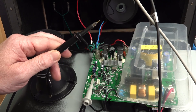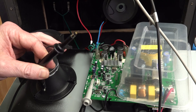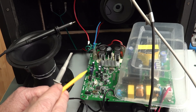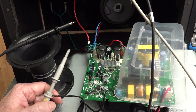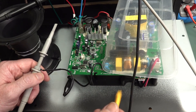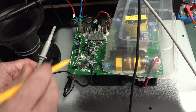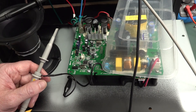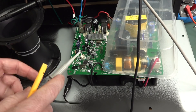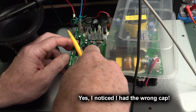So how can you probe two signals with only one hand? Well, I've got a tip for you. The first thing to do is find a readily available reference waveform point that you can trigger off. For example, if you're trying to power this product with the main switch, a power supply can often be a good thing to hook onto — like a 3.3V digital power supply. We've got through-hole caps up here, so we can actually clip onto the output voltage of the 3.3V rail.